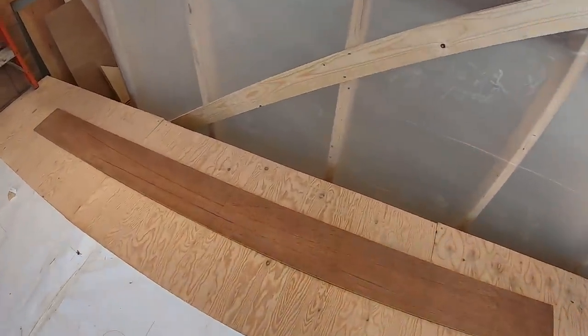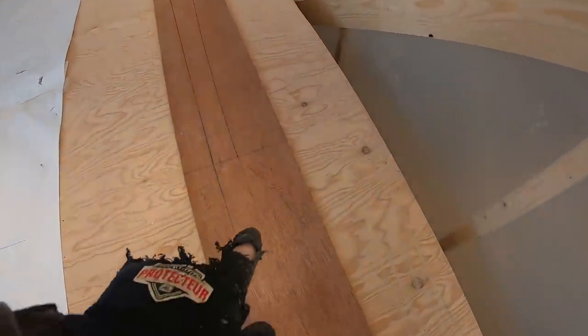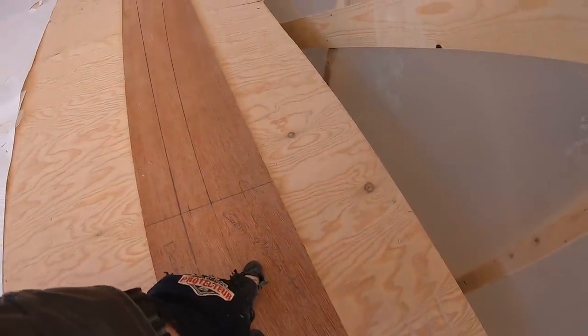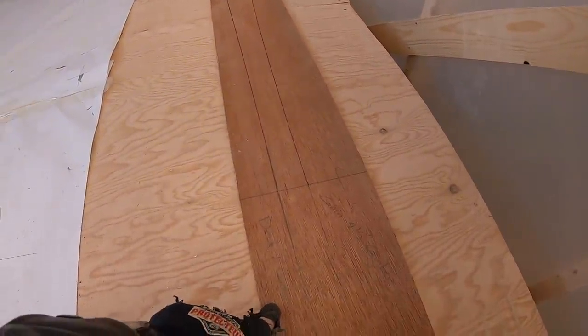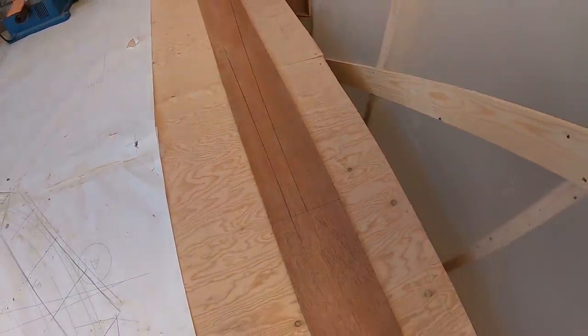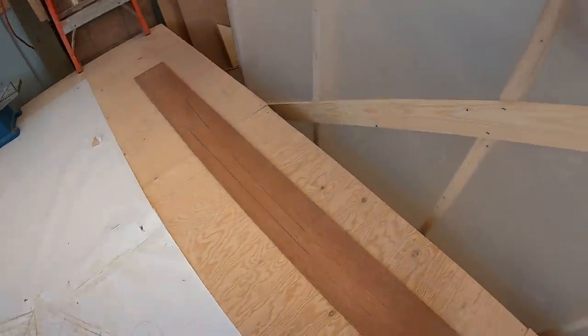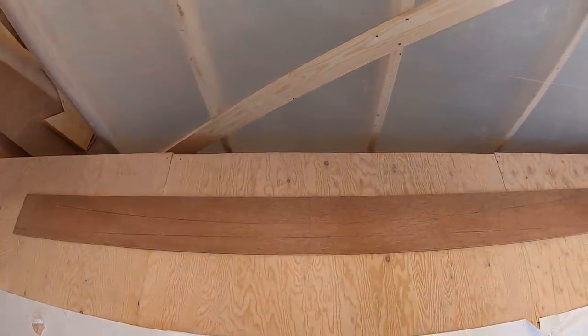While I was at it, I decided to mark the camber for the cabin top, which I'm making two and a half inches over eight feet. And I've marked the deck as you just saw me doing - one inch. So now I'll be able to get two different cambers from the same template. I'm only going to cut the one for the deck right now, though.